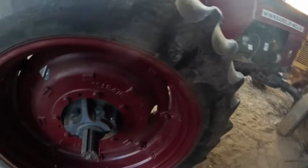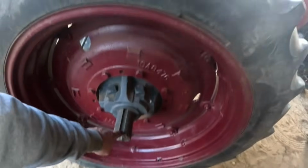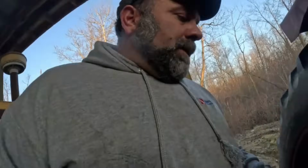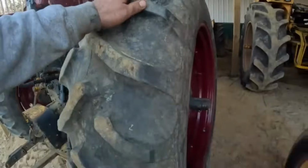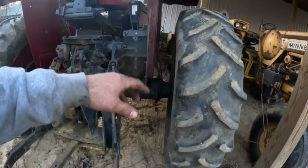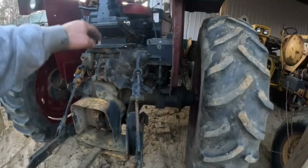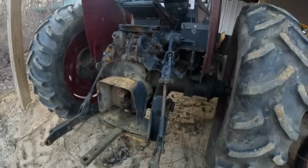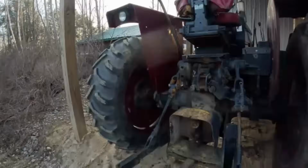Boy, I think they're just a hair smaller than a 900, I think. But I would assume that this is the same size as a 602. Don't quote me, I didn't look. M5, possibly. Who'd have to measure them? The difference might be length, or once you get inside the housing here. To change that, you'd have to take the whole hydraulic unit off. So you get down to the bull gear and all that would have to come off, and slide that out, because I'm pretty sure the bull gear is fastened somehow to the end of the axle there. You know what I'm saying?